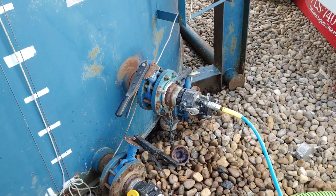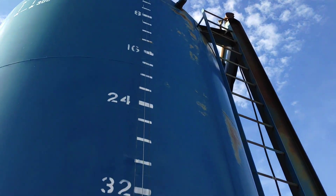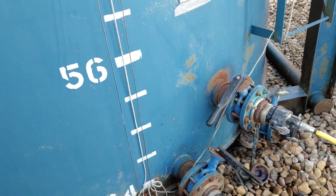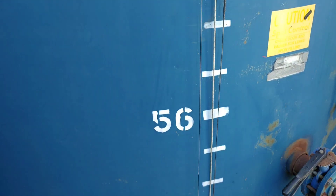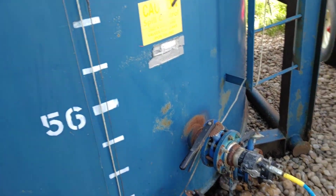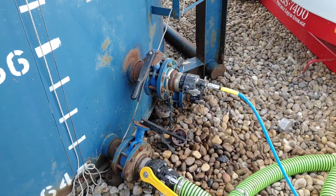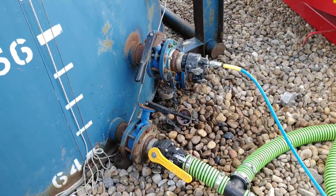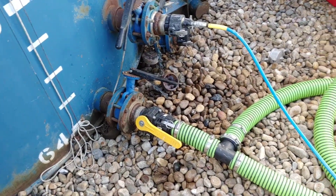We also use the compressed air in another place. When you're mixing multiple products together, it's always a good idea to mix them again before you pull them out. When this tank is right full of stuff, there's a lot of distance for things to fractionally separate. If you introduce compressed air to the bottom of a liquid tank, that air moves a lot of liquid as it goes up to reach the top, which causes liquid to come toward us across the bottom and away from us across the top. After a few minutes the whole tank is doing circles and literally jumping and vibrating on the ground — thoroughly and adequately mixed in only a couple of minutes. Air does that job in a small fraction of the time compared to recirculating with the pump. I committed a violation last night — I left my valves open. That's bad. That's why we have lots of valves, so nothing can get out and go anywhere.